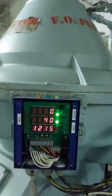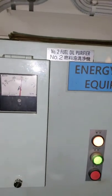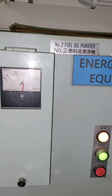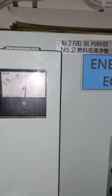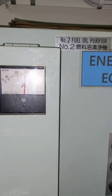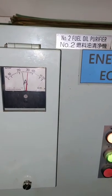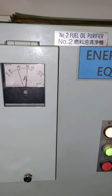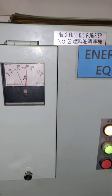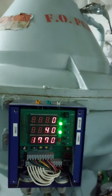On the multi-monitor panel, the RPM is slowly going up. The ampere is still 30 amps but it will go down to around 18 when it reaches rated speed. Now the ampere is slowly going down — you can observe the pointer slowly going down to around 19 amperes, then steady at around 18 amperes.